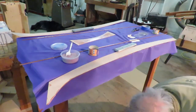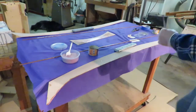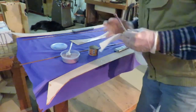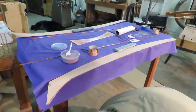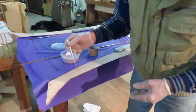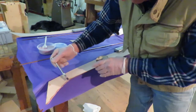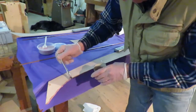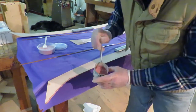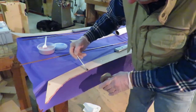So we can drip on the cardboard. Clean up that drip so we don't track it all over. That's probably the best thing to learn from this video - when I drip something I clean it up right away. It's tempting just to leave it, but you'll end up stepping in it. We're getting a fairly thick coating on this edge. It's a fairly thin edge so it's not going to hold much epoxy, but we're getting as thick a coating as we can without it dripping right off.